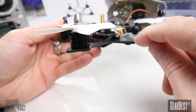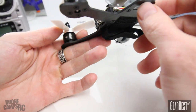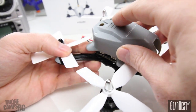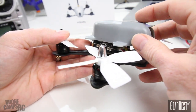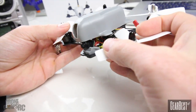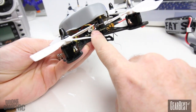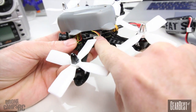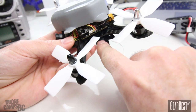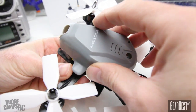You should be able to stack some VHB underneath here if you wanted to get a little more tilt — you might have to put a longer screw in the front. That's the way I have mine configured. One thing I don't like: see there's the USB connector on the side — that's not going to be exposed. The way this cable comes out on the side, this canopy comes really close to it, so you have to be really careful that you're not pinching these cables, because one wrong move and you could sever your cables and have to put a new connector on there.